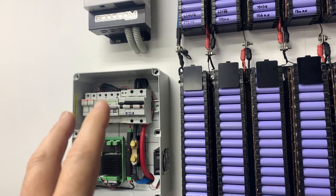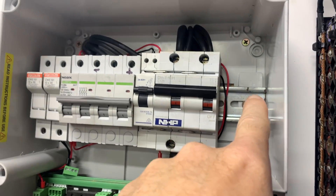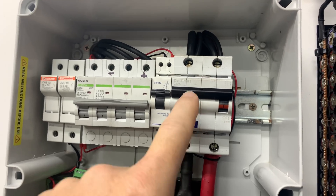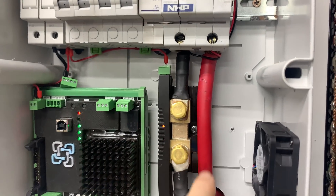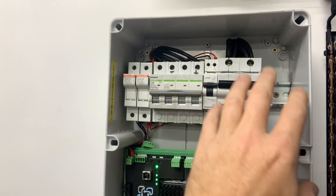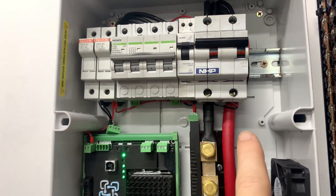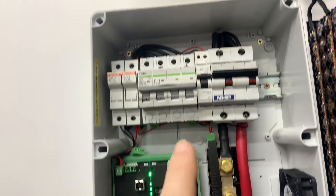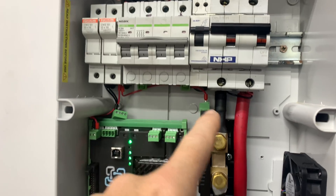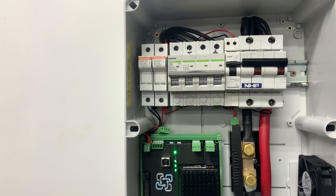I actually forgot to put the cables in for the inverter, but I've since worked that out. I've removed the breakers because I was going to have some breakers from this to my batteries, but it's going through this shunt trip anyway. So that stood the reason — I could disconnect all the power, and also clean up a whole heap of cables here and free up some room. Now, I'm not altogether sure whether or not this will be my final layout of all the cables. I still haven't done the ferrules here because I still don't know where I'm going to pull the power from. I'm not liking how all these cables are lying around — I think I might actually make a loom. Once I work out where all the cables are running, I might make a braided sleeve loom for all that to really tidy it up and make it look aesthetically pleasing.